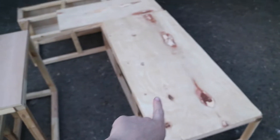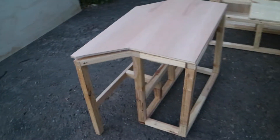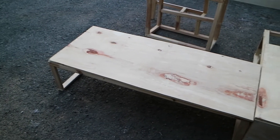Just did that one - that's done, that's cut out. What I'm going to do is put a piece straight across here and then have this because it's a shinier, different material to the ply. This is where my bed finishes, so I'll have a bedside table here - that's storage, so I've just got to make a lid for that. I've got to do a piece of ply on this side. I've got to figure out hinges once I've cut everything out - this will be a fixed one and then these two will have hinges lifting up on each side. I'll cut this in half and figure out the hinges. I'm getting excited!